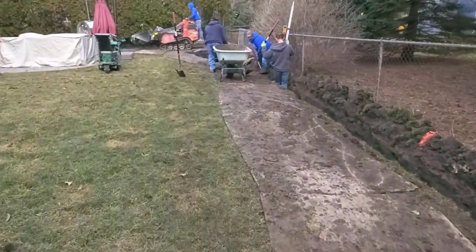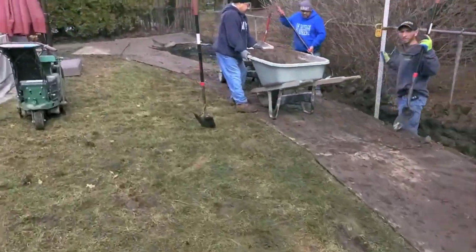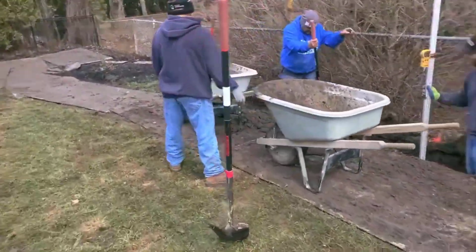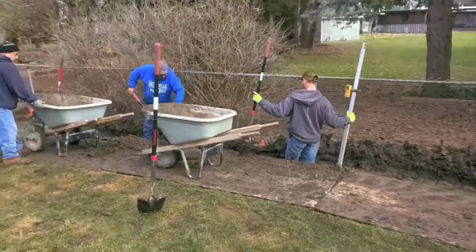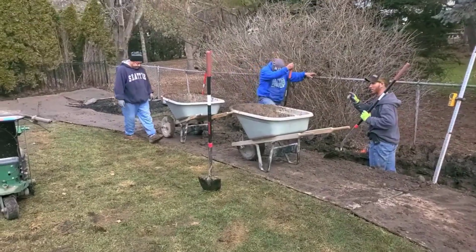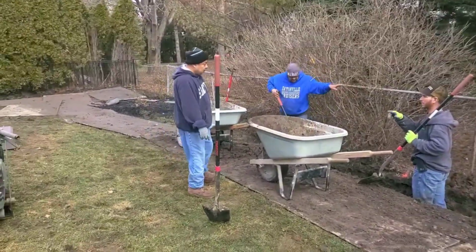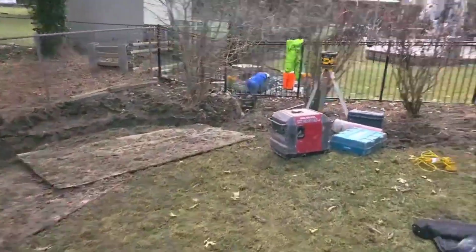And that's how you do a storm drain tap. People say, what is a tap? What are you calling a tap? We core it, and we remove a core of concrete, and then we go ahead and hydraulic cement a tap in the storm drain catch basin so that we can connect the French drain pipe directly